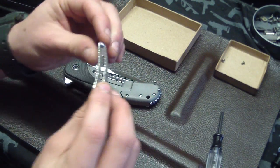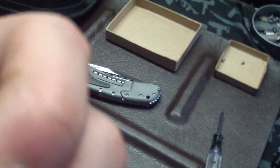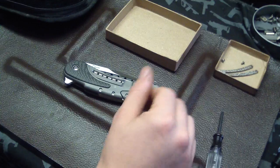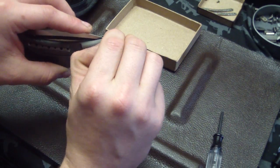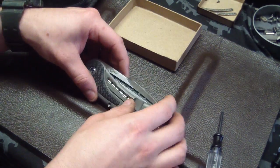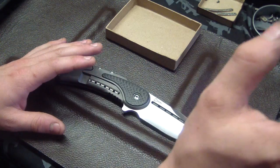I can see that ball works great — really great. It spins around and has movement to it, but it slides in and out of your pocket better than any pocket clip ever. I'll probably use something like this on one of my own knives in the future. I put the pocket clip aside separately from everything else so you don't get the screws mixed up. There are two standoffs there — I'll just leave those in, they're pressed in. You want to keep the knife open when taking it apart so the ball and spring don't fly out.